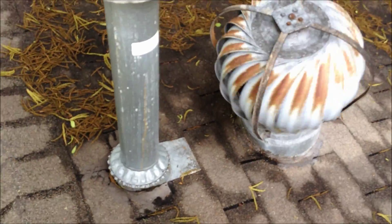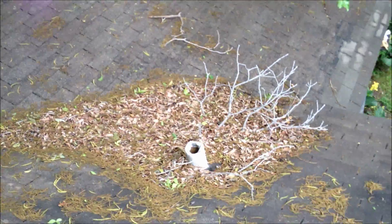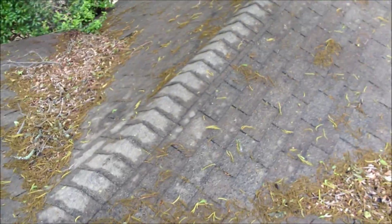There's a lot of stuff in the valley, and that's really problematic because it'll create a dam for the water — the water will build up and then it'll leak in there. So this is a house where we'd really want to use ice and water shield to make sure they don't have leaks later on. There are also a lot of limbs overhanging the roof that all need to be trimmed back so they're not rubbing on the roof and causing damage.